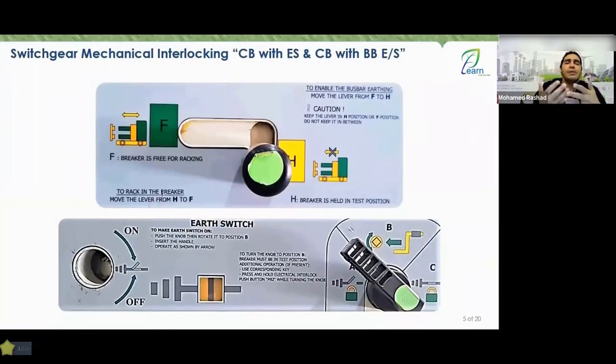Now, with the lever, for example, in a scheme like ABB, there might be something like a plug, and you have something called RL1, RL2, and RL3. It's like a plug that when you try to rack in the breaker, this plug stops you, so you can't rack in. But here, it's a mechanical system in the ABB, so it doesn't matter. They all have the same idea. There's a position where you can rack the breaker in and out, and another position where the breaker must be racked out. If you set it to this position, it won't be allowed for you to rack in.